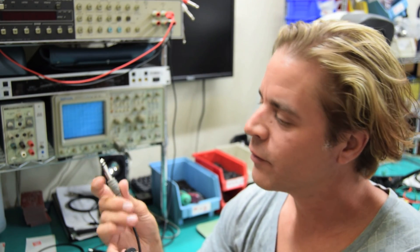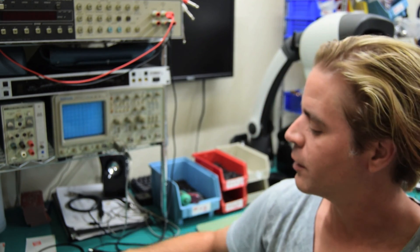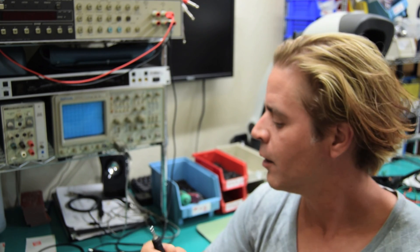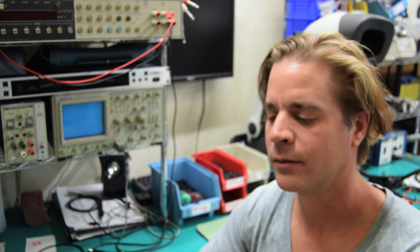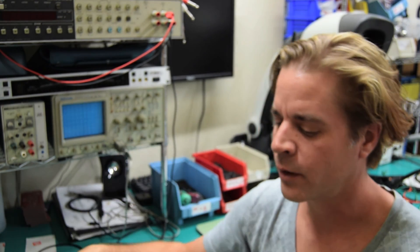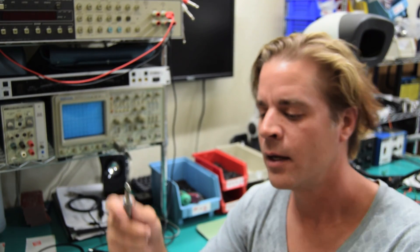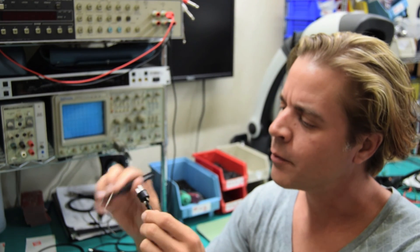This is how the S-trigger cable comes apart — we've got a quarter inch cable on this end because I made this to work with my ORB sequencer. If you want to use it with the 512, you can use a quarter inch to eighth inch adapter. Or if you want to use it with Eurorack or 512-type stuff and need a 3.5mm or eighth inch connector, just start with one of those and wire it up the same way.